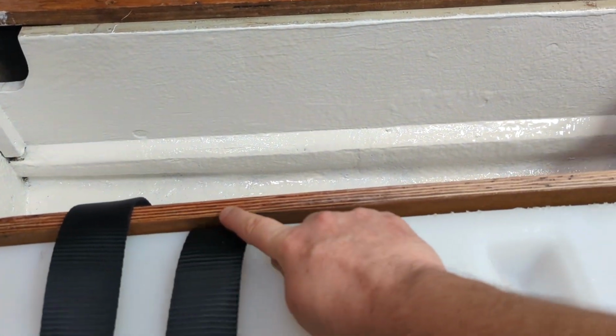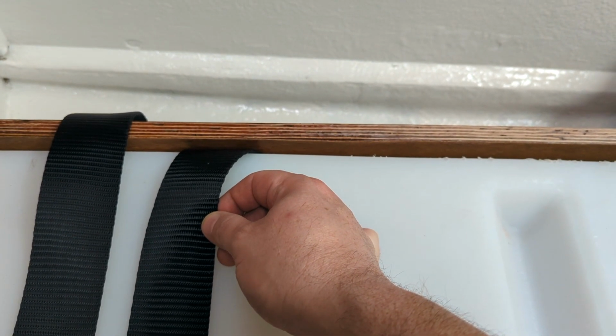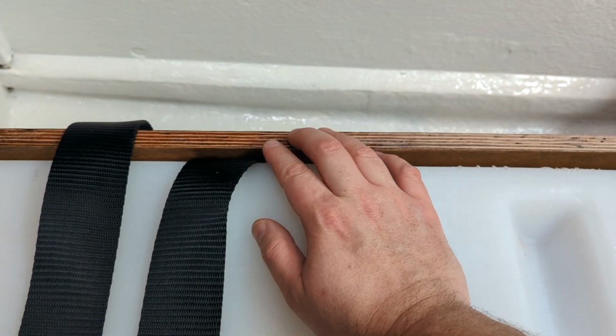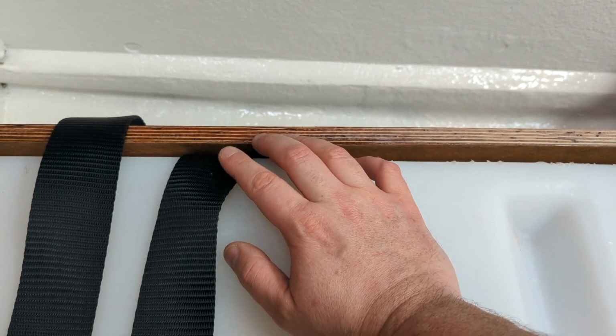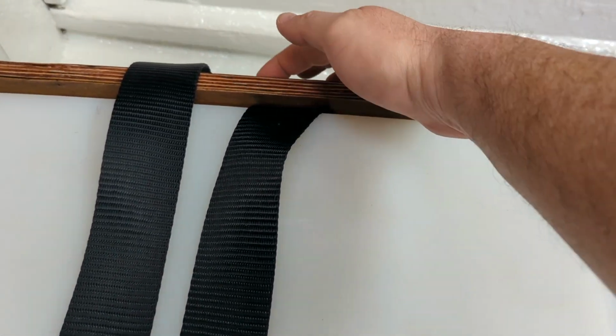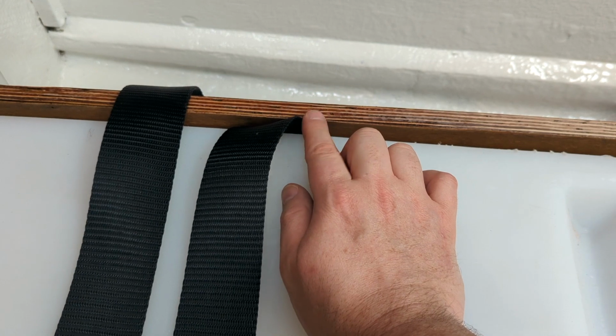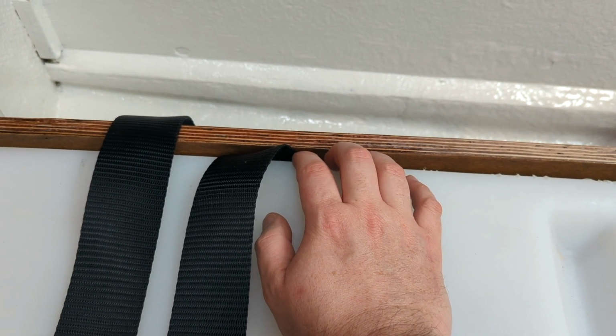So I'll just notch this out at basically the same or a little bit bigger thickness than the strap. Then I'll come down, I'll sand it smooth too, so it's not like the strap is on a rough surface. And then I'll have some washers and through bolts and countersink like that. That should work. I think that should work. I'm gonna play around with that a little bit and not make any cuts until I've got a full-fledged plan, but I am thinking that'll work.